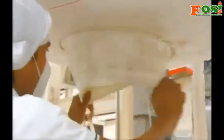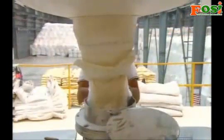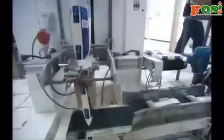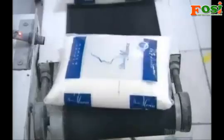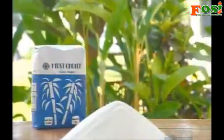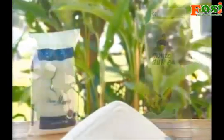The hoist lowers each bag over a chute that leads to the factory's main floor. Workers carefully open each bag in turn and pour out the sugar directly into the chute. It feeds an automated packaging machine, which fills a series of 2-kilo plastic bags, seals them, and separates them. This packing facility produces 200,000 bags a day, processing 400 tons of white sugar daily. This fine plantation white sugar is available in a variety of convenient packaging options — and that should sweeten anyone's day.